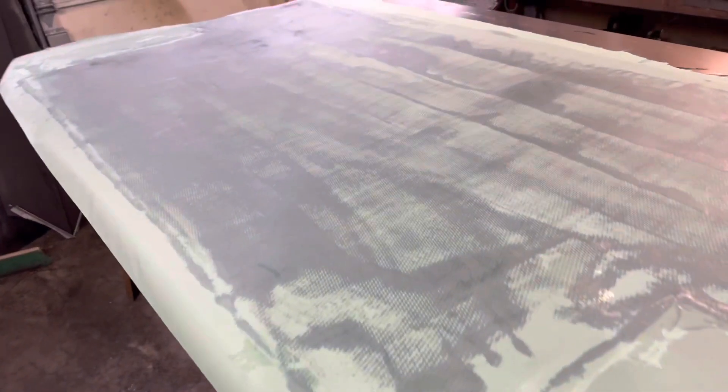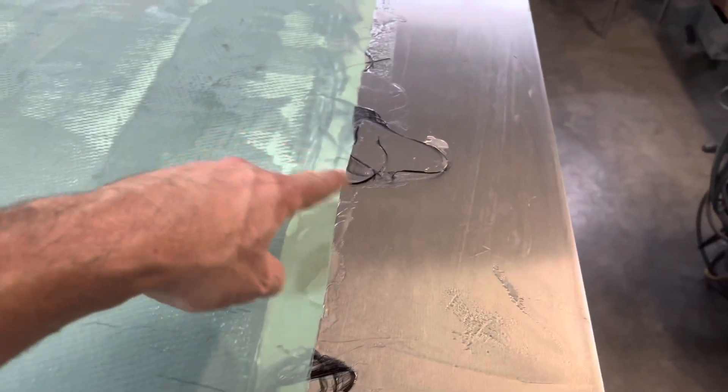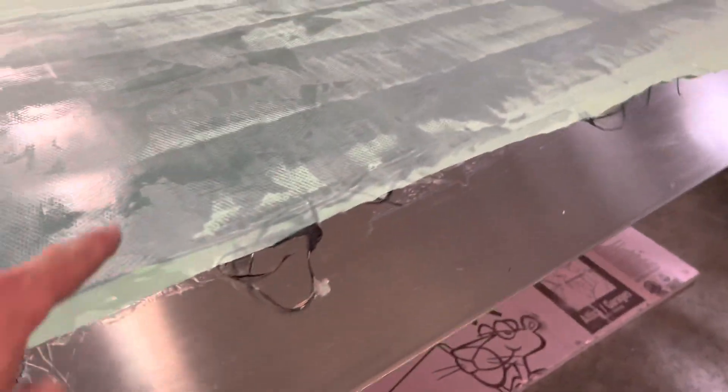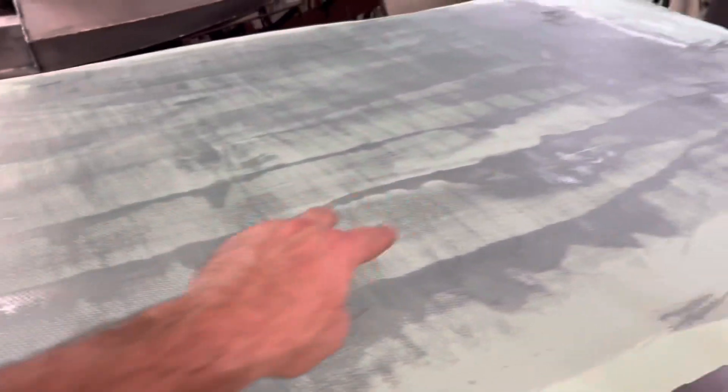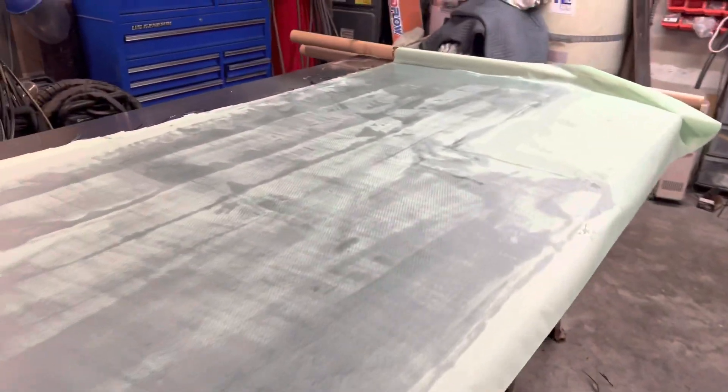One of the reasons you want to use this peel ply is it really lets you get aggressive with the squeegee without damaging the fibers. When you start to work it with the squeegee, the fibers are going to start to come loose on you on the edges, and you can damage them in the middle. So when you put this peel ply on, it really lets you get aggressive with it and you can get this thing nice and flat. This turned out pretty good — I'm pretty excited. We'll peel it up on Sunday and that'll be a different video. Time to clean up and get out of this mask — this stuff is nasty. We'll catch you next time, thanks for watching.